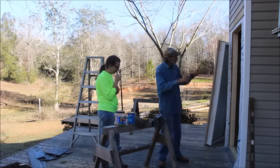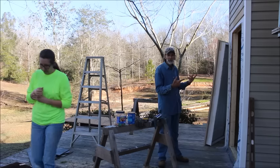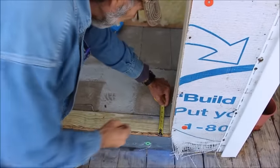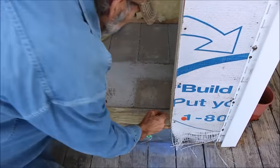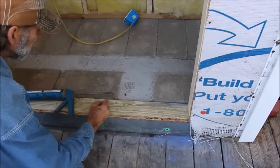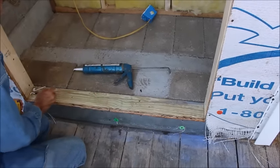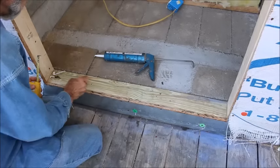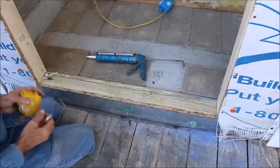Now we've got to go back and tack the plywood around the edges, because after we cut it out I had no way to do that from the inside. So we're going to do all that from the outside. What we're doing here now is making a line where all my caulking needs to go, because underneath the door it's got hollow spots and I want to make sure I get a good seal underneath the bottom of the door. It's supposed to be about three inches in — that's what we've got right there. That's where your caulking needs to go under the door.